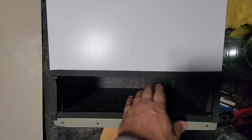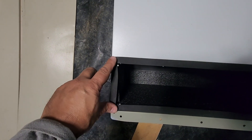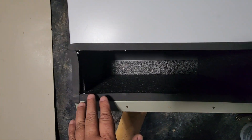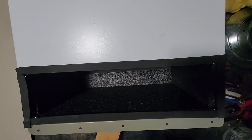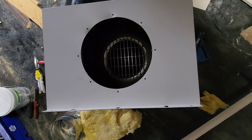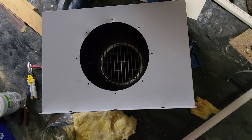There's a little bit of insulation that's already perforated — that comes out, and then just apply a little bit of the adhesive gasket tape that is provided in the kit. That ensures a nice seal up against the ductwork. Same thing with the top — that comes out really nice, thanks to the perforations they put in there for you. And now we're ready to put a collar on.